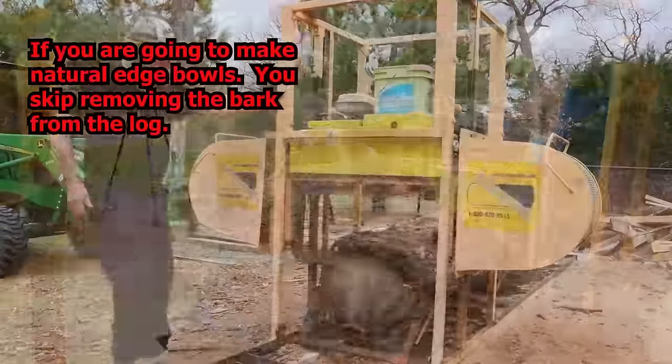And there also is a 5/16, which is one size smaller. We've had some accidents in our shop, our woodturning club, with that 5/16 screw chuck. If you get an 8 or 10 inch bowl on there, it will tear the wood out of it with the threads and come off your lathe. So we banned all the 5/16 size ones in our club, and we only use the 3/8-inch screw chuck.